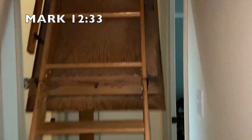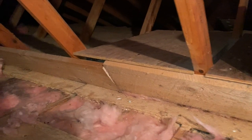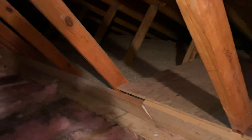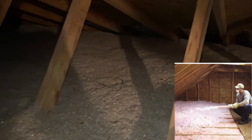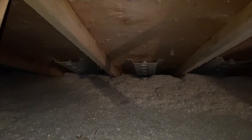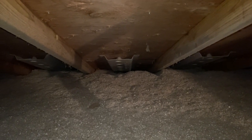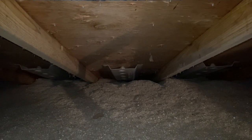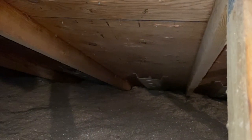I'll show you my attic. This is a spot you're probably going to lose most of your heat — this is probably the biggest job. Blow-in insulation is the easiest way to insulate. Now if you happen to do this blow-in insulation, make sure you do not block the channel that goes out to the overhang of your roof — you've got to let that breathe up through there, otherwise you'll end up getting condensation and things will rot out. So you need to get those little foam baffles at Home Depot and put them in between each rafter. That's a pain, but it definitely helps.